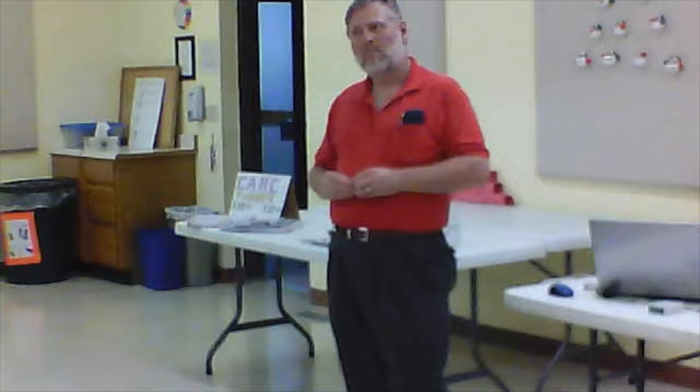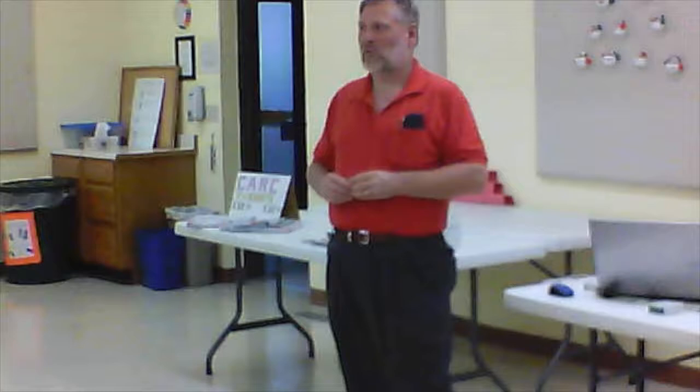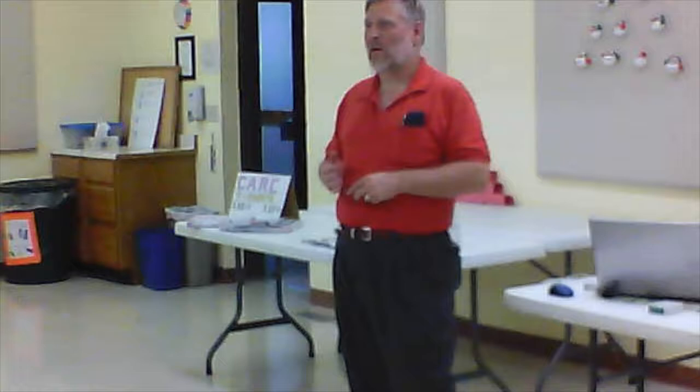Have you or anyone here experimented or used the deep decode? I usually have deep decode on. I actually turned it off for the first time a couple of days ago to see what the difference was. I really didn't see much of a difference. But I would think the deep decode might work better up on 15 or 20 meters, a little bit quieter band, where you decode under the noise floor a little easier.